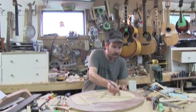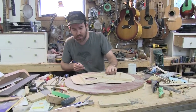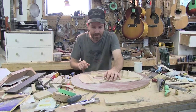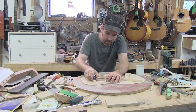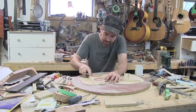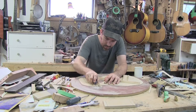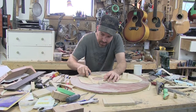I will also try to refer to the soundboard and the braces without using genders. So this brace here, usually what I'll do is I will round it like a Martin style brace. So if you take a little bit off the right, a little bit off the left, and you try to be relatively even. Slowly round it.